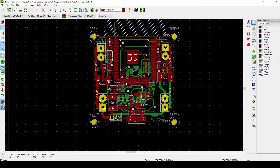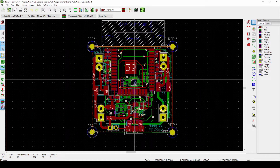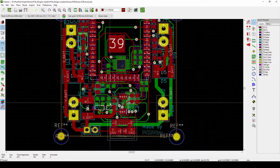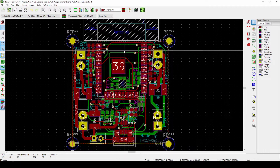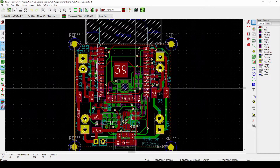Now let's look at the PCB. There are some improvements I could have made — that's another video about how to optimize your PCB and routing. I did make some mistakes, and I'll make another video about reducing susceptibility to EMC/EMI. For basic things: with the ESP32 it's always good practice to have it on the edge of the board, because with the antenna you don't want anything running underneath it. You can place it in the middle of the board but then you may need a cutout. Best practice: keep it on the edge and check the datasheet for placement guidelines.